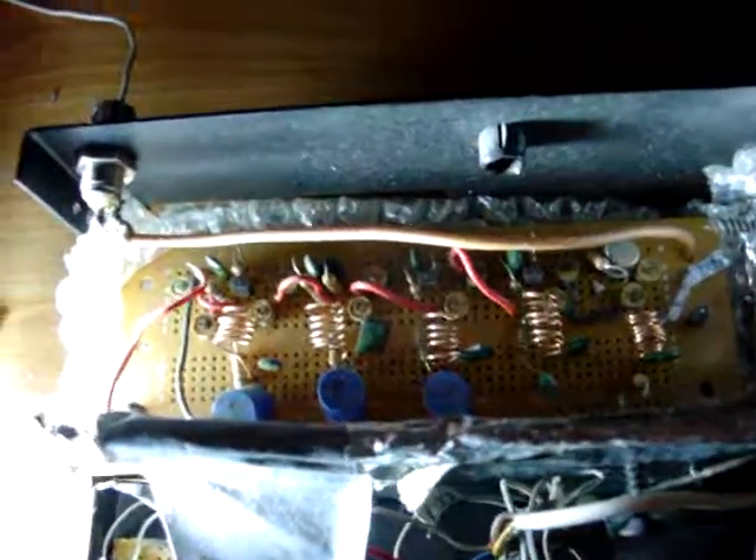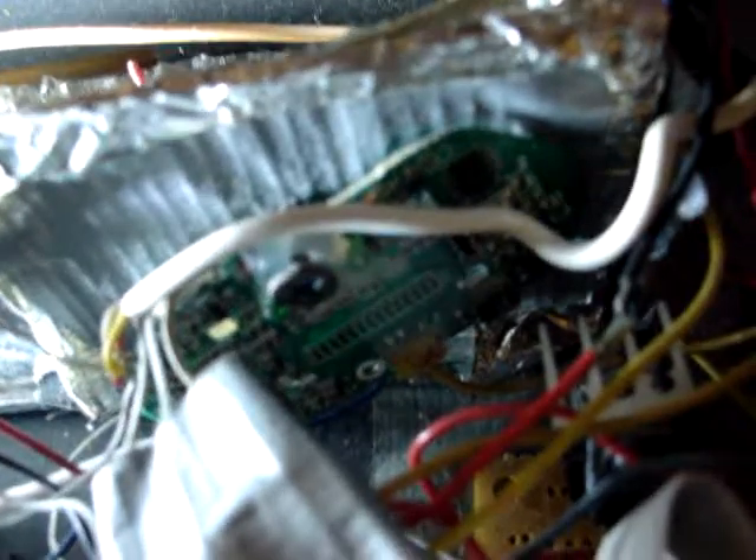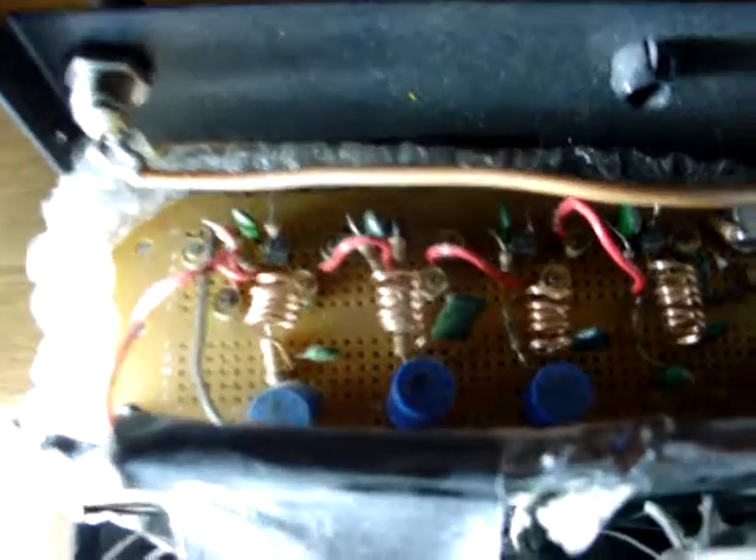The amplifier is a five-stage setup. You're probably asking why there's so many stages — three reasons. Number one, the TuneCast is not a 50-ohm output and I'm using a 50-ohm pigtail cable that goes around as shown there, but the TuneCast is not 50 ohms. I don't know what impedance it is, but it's hooked straight to the output where you remove the inductor to increase the power. Reason number two is these transistors are your generic Radio Shack 2N3904s or 2N2222s or whatever, which are not really suited for this application. Yes it works, but it's not efficient at such a high frequency to where you're going to get gobs of gain out of it, so you need a lot of stages.